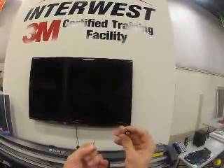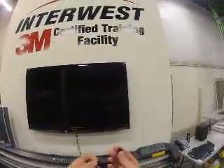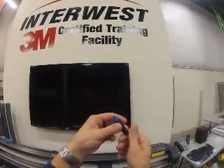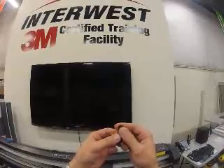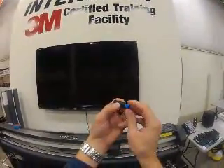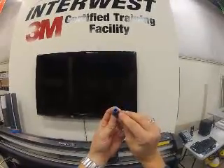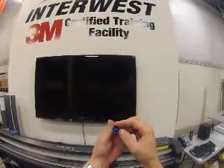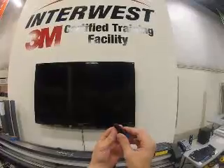I'm going to take the actual bottom of the blade holder and insert the actual blade in there, then go ahead and tighten the bottom back on. With this, what you're going to see is you actually have your blue dial. On your blue dial you've got one crosshatch, and on your actual black blade holder you have five crosshatches. This is actually how you're going to adjust your blade depth.